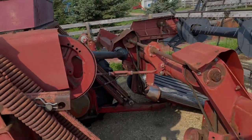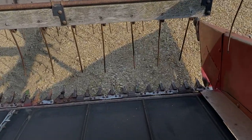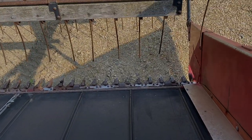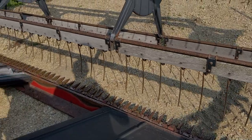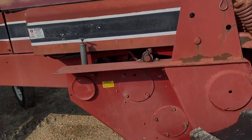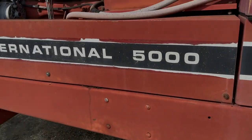You have to adjust the spring tension because these old units are controlled by that. I'm going to have to loosen these off just a little bit on this side - it just needs to be loosened a little bit so it'll sit on the ground better. Once you put some crop in it, it'll definitely hold it down, but we're just picking up wheat this year. Also noticed there's some worn-out bushings in here - probably nothing I can do, but it'll still work.